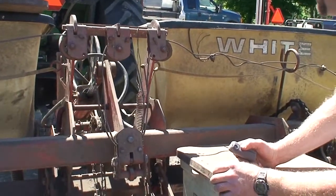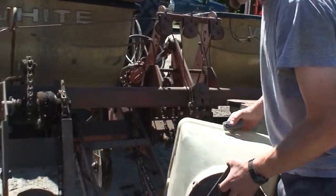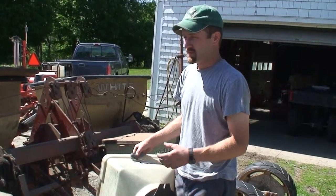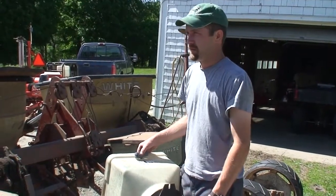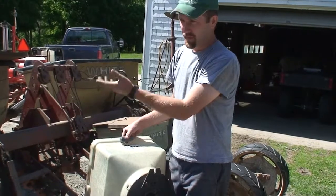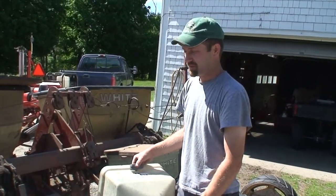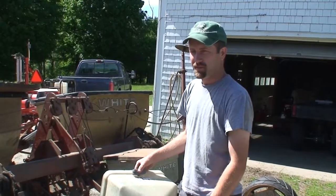It's really key to always check your seed. If you don't have seed monitors, a lot of planters will have them to tell you if you're getting the correct amount of seed down and if you have any problems like throwing a chain. What I typically do at the end of every five or six rows — rather than stopping and picking the planter up — I'll raise the planter while moving forward, then back up and look on the ground. I should be able to see four places where seed was on the ground. That's the old-fashioned way of checking, but you always need to check, because if a clod gets stuck in there you'll have a whole row of beans that aren't planted.